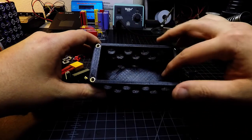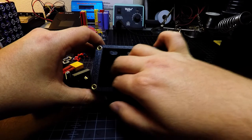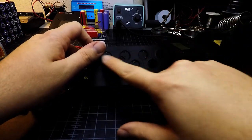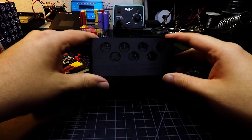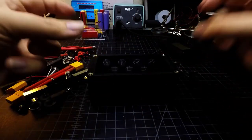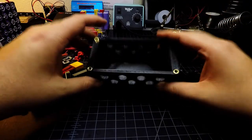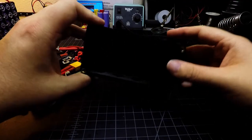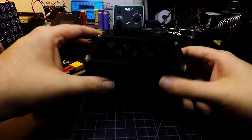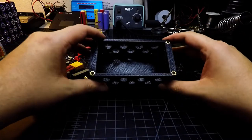I moved the mounting posts for the shunt back appropriately to give plenty of clearance for the XT90 connectors and wiring coming through. I also put some vent holes in this box because I'm not sure how much heat to expect inside when it's all closed up. The vent holes allow some passive airflow through it so I can hopefully avoid heating issues — or at least feel heat radiating through those holes if there are any.